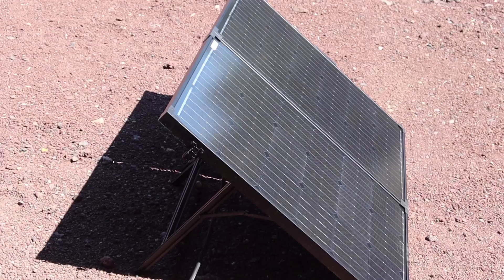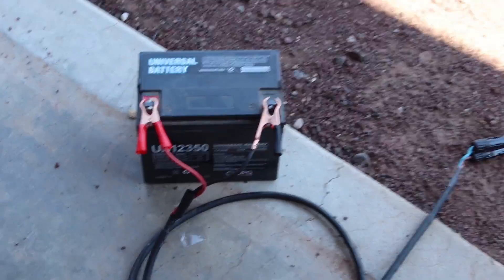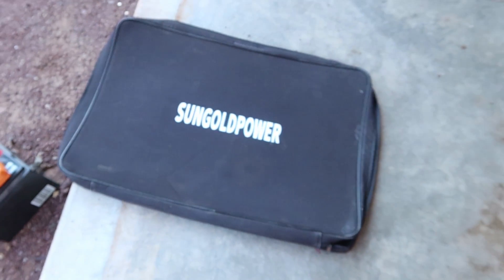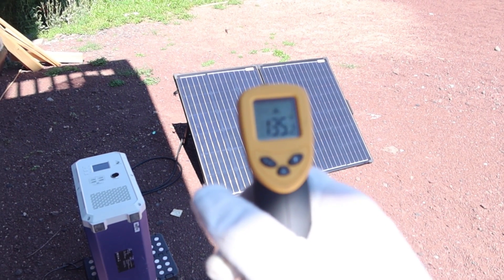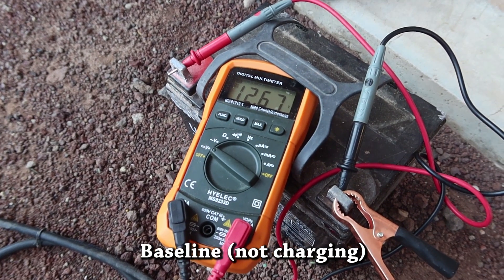Do note that the SunGold Power's solar controller will not come on unless you hook it up directly to a battery — and when I say battery, I mean a lithium or lead-acid raw battery, not a solar generator. I now have the SunGold Power hooked back up to a typical old lead-acid battery. This one's actually showing 12.6 volts, so it's not dead — we actually have a functional battery. Let's hook it up to the SunGold Power. It is certainly charging; look at that voltage climb pretty quickly. The clamp meter on the positive terminal is telling us we're pulling in about almost half an amp.